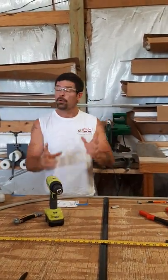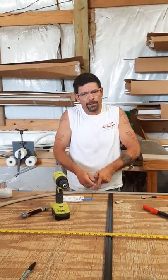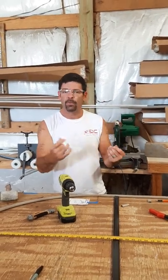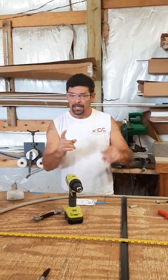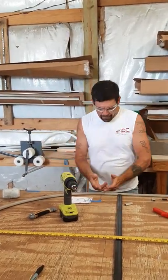My customers — unless they say otherwise — I only put the rivets on the spline side. The reason is I typically install it with the spline pointing in and the smoothness of the frame pointing out — I find it more beautiful. The frames are rigid aluminum, whereas the rivets are a very cheap metal painted the same, but they will not last as long as the aluminum will. So I try to put those on the inside so that as they begin to deteriorate or the paint begins to fade on that cheap metal rivet, it's not seen. Instead, you have a gorgeous frame. I use high grade — I think they're the prettiest frame in the whole country. It's made here in America. It's beautiful. You can go to the big box store — it doesn't matter.